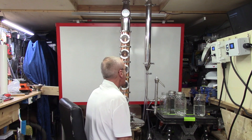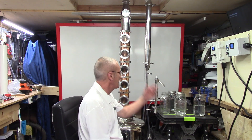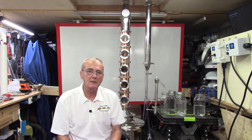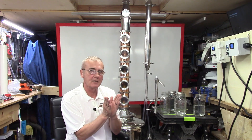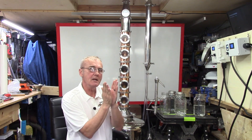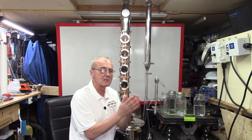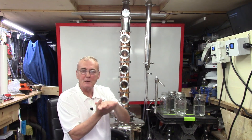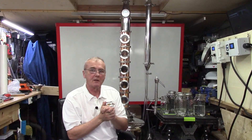I'm at the point now where I'm still at 95% alcohol by volume. I'm going to let this thing run — I've got three half-gallons collected. My kettle temperature is at about 198°F — it started at 190°F and now I'm at 198°F. What does that tell me? That's an indicator that the mash left in the kettle is starting to increase in temperature, which means the alcohol level is dropping. The temperature will start to rise gradually. You can see me checking everything again.